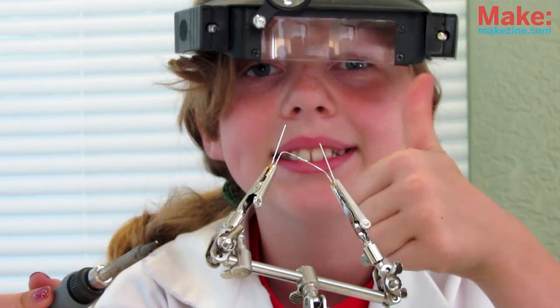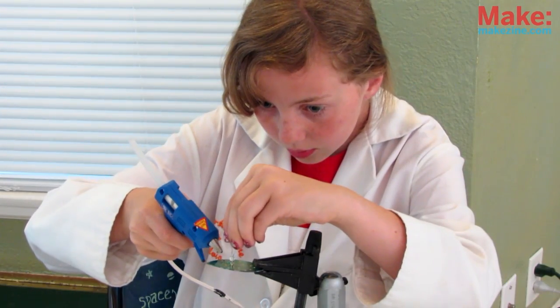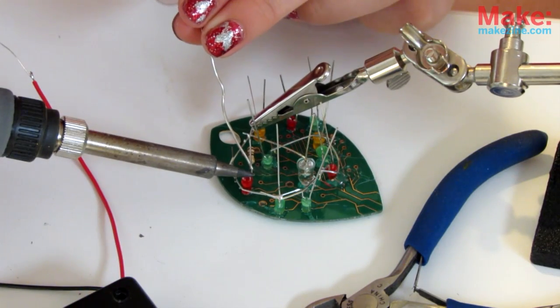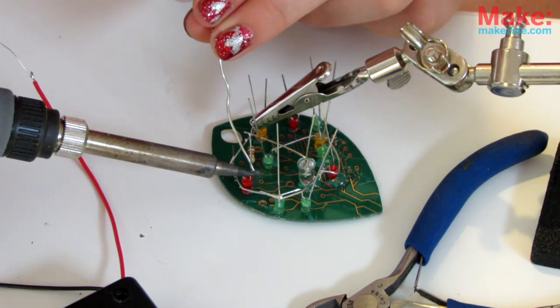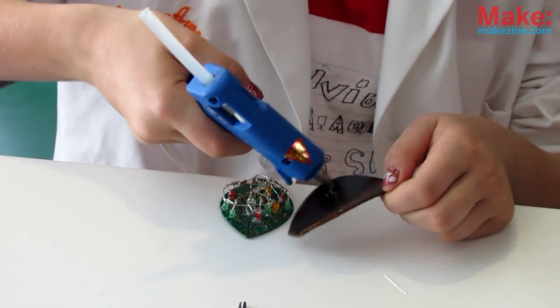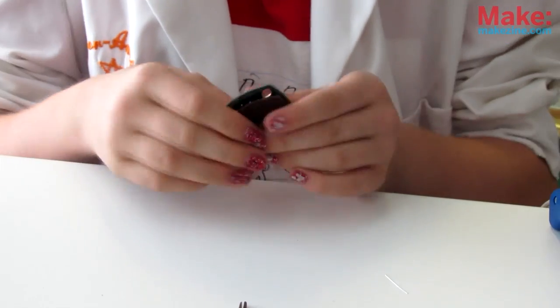If you're doing this with an old or custom pendant, you can simply solder the LEDs to each other, dead bug style. Short lead is ground, then hot glue them on. Or use a proto board for a nicer looking circuit. I'll be covering the whole back with some soft material when I'm done to help protect the circuit and me.